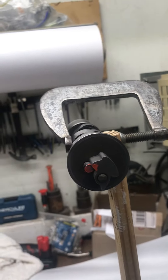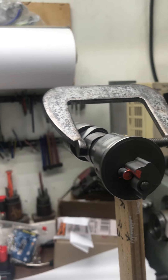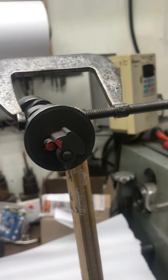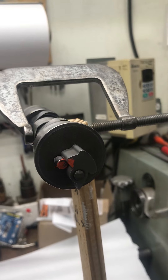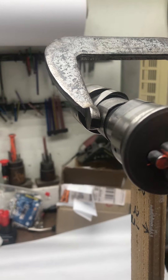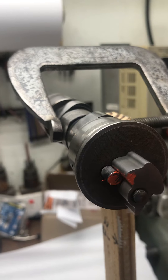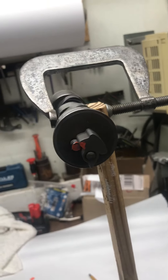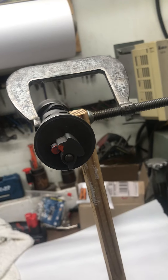This is the final video. The Polaris manual has a very cheesy description of what the spring preload should be, but they don't tell you that you're supposed to fix it yourself. You can Google this on YouTube — guys use three or four springs and they don't work. Don't worry about making too much force on the spring because in wintertime this thing is soaked in oil and it doesn't move so easily, so it's got to overcome that oil stiction. This fix did work perfectly — we fought this thing for the longest time on this '98 Polaris 500 Sportsman.